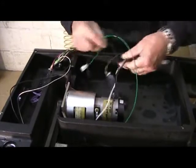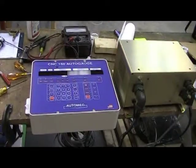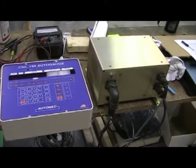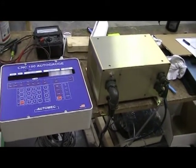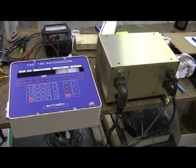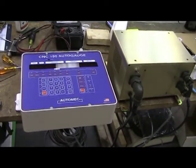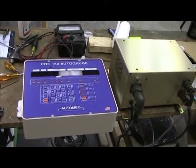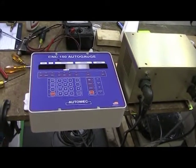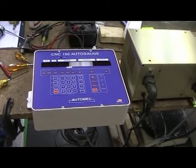These are all plug-in connections. The other components you will receive are a CNC-150 control and a gold amplifier box. This amplifier box should be mounted to the side frame of the press brake using four quarter-twenty bolts. All of the electronics for the system is included in these two pieces, so the Herco control box can be removed as well as the Herco controller hanging from the pendant.